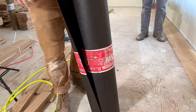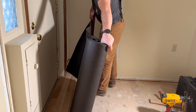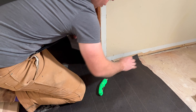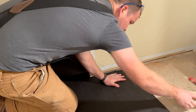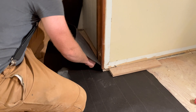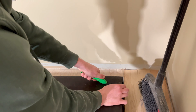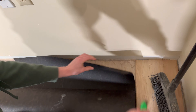We're now going to put down some 15-pound roofing tar paper as our moisture retarder — and notice I didn't say barrier. It's not going to block the moisture; it's simply going to slow down its transfer. If it did block the moisture, your subfloor would rot. So if a house has moisture problems, you cannot install hardwood in them until it's fixed. In a house like this we're working over a nice dry basement, but over a crawlspace house with open earth underneath, we're going to be a lot more concerned about moisture.